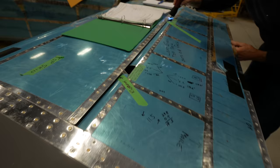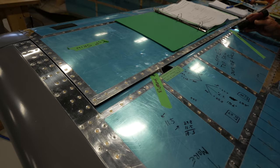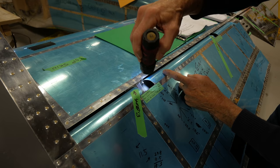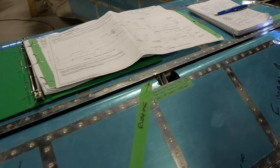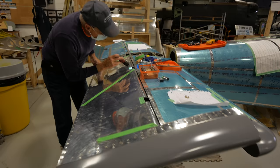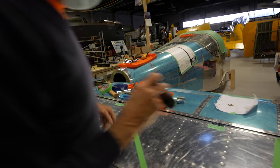When I was alone in the quiet hangar later that evening, I noticed there was some rubbing, so I marked it with green tape to discuss with Perry the following day. This is a pretty normal part of the process — finding small interferences you've got to fix. It's just a matter of compressing the radius so that the rivets joining the half-radiuses together don't touch the hinge brackets. It's meant to be very close so that in neutral there's almost no space, primarily where the weldments are — about 32 thousandths.